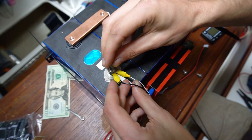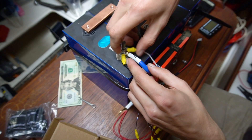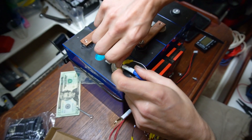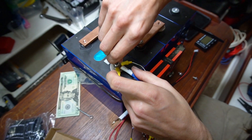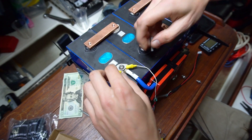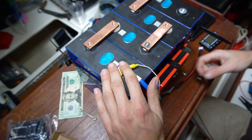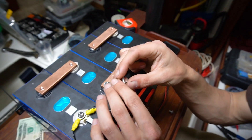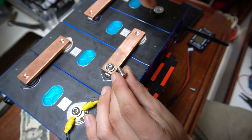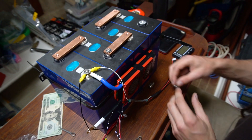Because these batteries are fairly cheap, a lot of reviews say you really don't want to tighten down these bolts too much, so for now I'm just going to hand-tighten them. I'll get everything tight after the fact once we're actually installing them. It's only meant to be about eight Newton-meters of torque. Right there it's actually bottoming out, so we're going to have to replace these bolts. It's recommended to replace them with studs — threaded rod that you put nuts on — to stop it from stripping out the terminals.